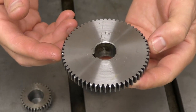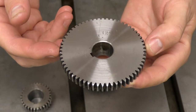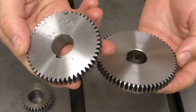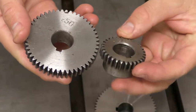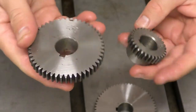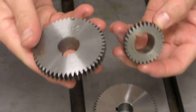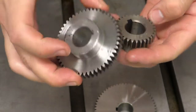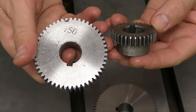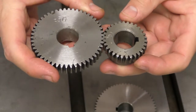It might also say there's a 40% chance of being 1.25 module. If you've got samples, you can just keep measuring all of them and punching them into those online calculators - it really takes the guesswork out of figuring out if it's metric or imperial. The bores are imperial, the outside diameters look imperial, and it points to diametral pitch.